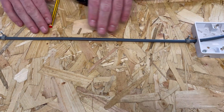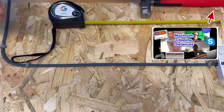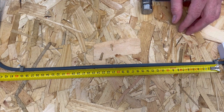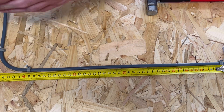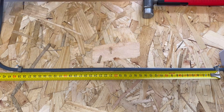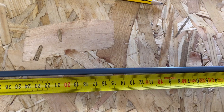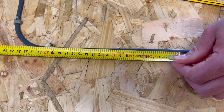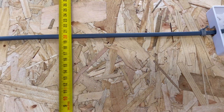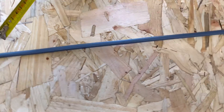I've said in a previous video that I like my clipping distance to be a maximum of 300 millimeters - I'll leave a link to a video where I talk about clipping distances. I'm going to measure this gap and that gap is 390 millimeters, so I'm going to need to half that. Half of 390 is 195, so we want this to be 19 and a half. Putting pencil markers in - 19 and a half from clip to clip. Let's check it the other way: clip to clip, 19 and a half. That's the correct position and it should be 19 and a half off our hard edge - and it is.